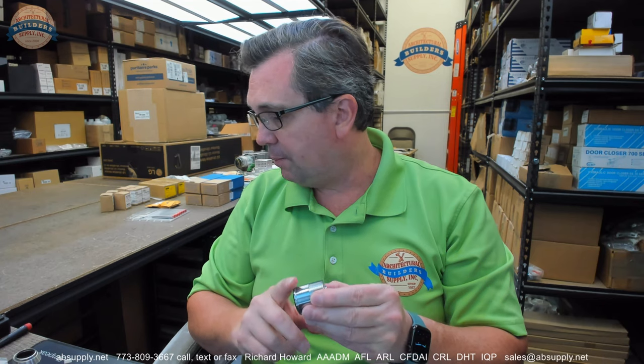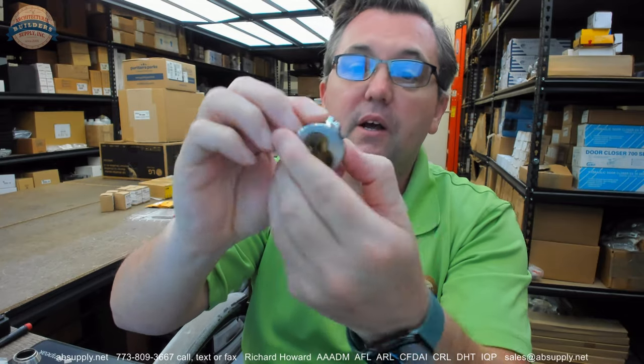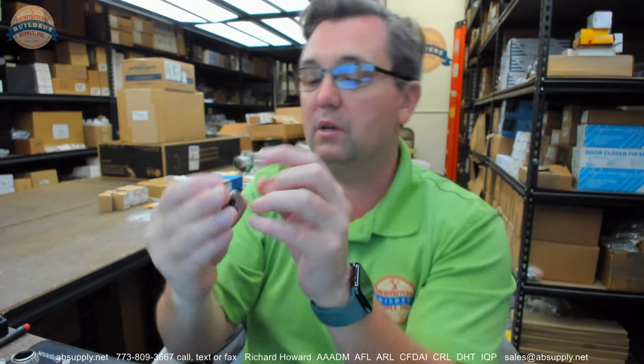Very typical. This is made of brass. It features a milling on the side so that when you install this into your mortise lock, you'll tighten those set screws and they'll fit inside of that milling. The Best mortise housing also has a hole that's been drilled and tapped — that's for the security screw that you will install. This package came with two screws, and I'll show you both of them.